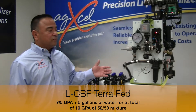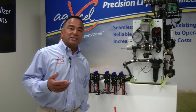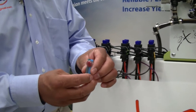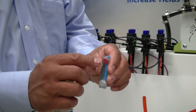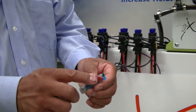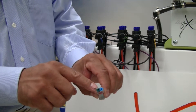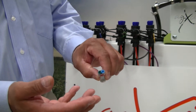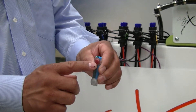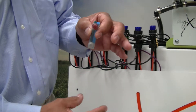The system that we designed for this type of fertilizer would be our GX6 solution. Our GX6 solution utilizes microtubing. The big difference between microtubing and orifices is that the orifice has a very small hole to measure the liquid and create back pressure. But the theory behind the microtubing is that the small hole on the orifice is, in the microtubing, twice the size. You're still going to get the back pressure to achieve an accurate rate, but the inside diameter is much larger than the orifice, which allows heavy or viscous liquids to flow a lot more easily.